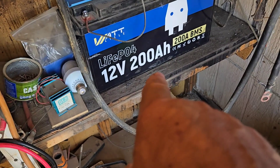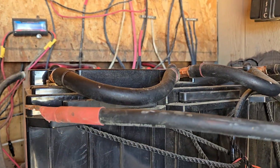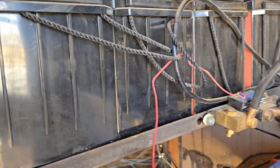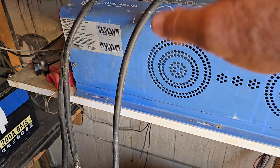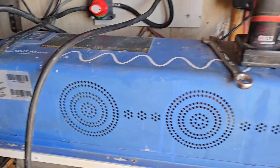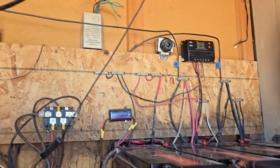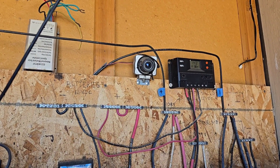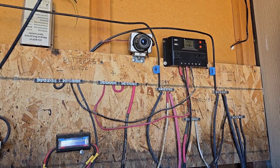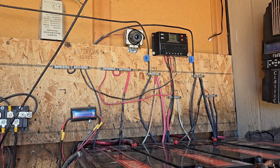Once I take all this stuff out, I'm going to extend that shelf across the bottom and put all those batteries directly below the all-in-one. For right now these wires are going to be reaching across to make connection, and I don't like that — it'll all end up down there where I can have the wires going straight down the wall and clean this up. The Rover is still connected, but I'm going to do some modifications on the wiring coming in for the solar panels — those two black wires up there are coming from my six 305 watt panels, and those are going to be switched over from series-parallel to series.